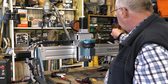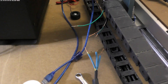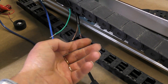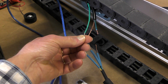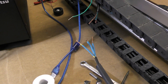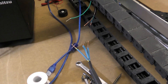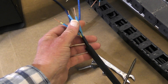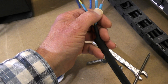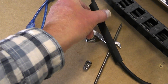I've run it through the cable chain and brought it out down here. Here's the cable coming here where I've pared the wires back — there's the earth lead. This is a power cable off a Hewlett Packard printer power cable actually; the printer went out years ago but I reuse everything I can. I've pared the wire back, I've got some shrink wrap on here, and I'm just going to solder these together. I've got some shrink wrap for the outer side as well.